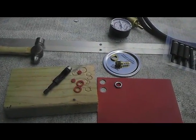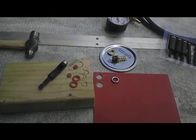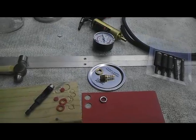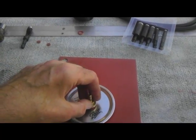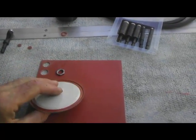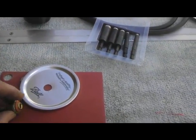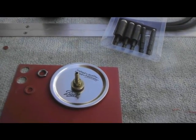Now that the washers are made, we will proceed to drill a hole in the center of the mason jar lid and then mount the little fixture nipple that we have in order to attach the vacuum hose from the Harbor Freight brake vacuum pump. The hole is drilled. The first part of my nipple assembly is put together. I'm going to fit it through this hole, and once it's through, I will place the other gasket on the opposite side and then bolt it together.